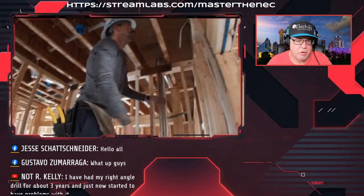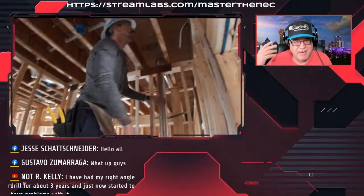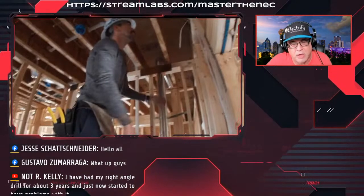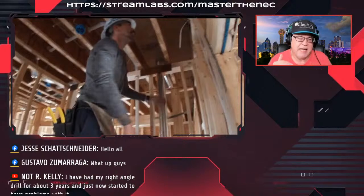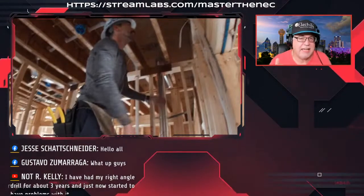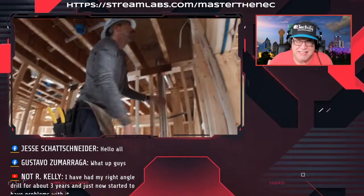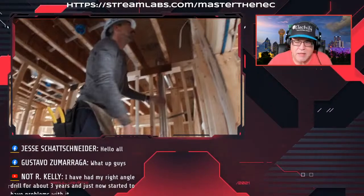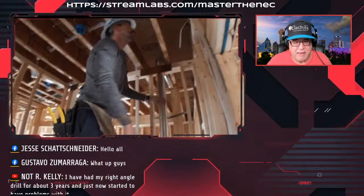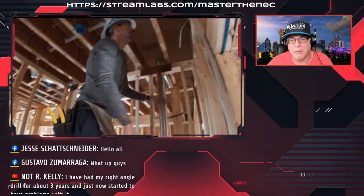Like somebody ends up getting a computer, they're a gamer these days, and they plug it into the bedroom, and it ends up tripping a breaker because you have a lot of lights on, and then you have the receptacles in the bedroom on it. So, again, you really have to plan it out. His approach here is he looks like he's just doing this circuit for the lighting. So if you think about the rooms that he said, and I said that you put upwards of 10 to 12 as a rule of thumb, you got to remember that because they're LEDs, and he's made that statement, that means they've done this before, the wattage is going to be pretty darn low. So he can get away with that.